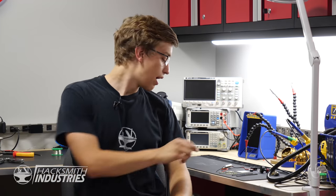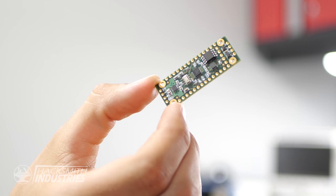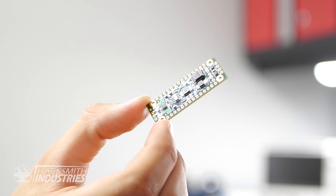To make the gun scream, I'm going to be using a Teensy 3.5 microcontroller to read sounds off an SD card and play them back in response to input. That's going to get amplified by a PJRC prop shield, which also has an accelerometer on it that we're going to monitor to see when the gun's being shaken.